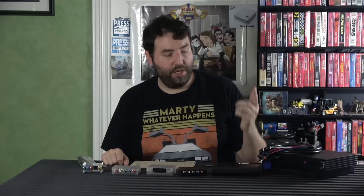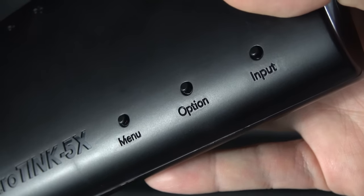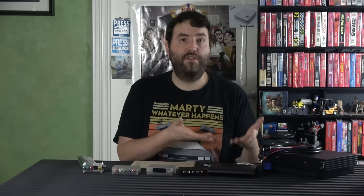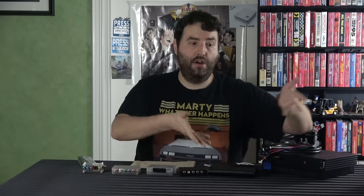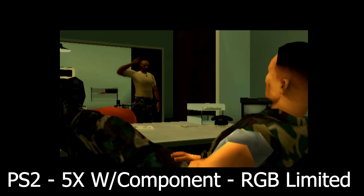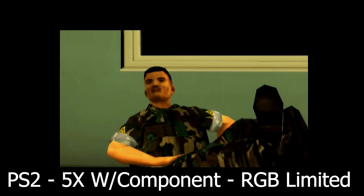Updating the device is pretty easy, as it always has been with RetroTINKs. You take the included USB micro cable, plug it into the device and your computer — make sure you're holding down menu while plugging in, which sets it into update mode. On Mike's website you can download a basic PC app specifically for updating, and the firmware file is also available there. The software detects the device, you load the file, hit go, and it takes a couple minutes. After the update he added the RGB color space option and also fixed a typo — it originally said 'shart' instead of 'scart.'